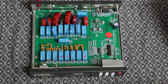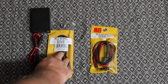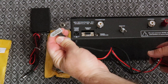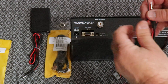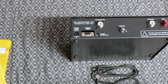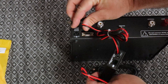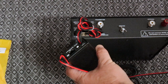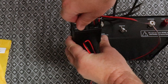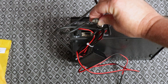These are the interface cables: the MFJ 5124 for ICOM radios and the 5124Y for Yaesu radios. For the ICOM IC-7300, plug this into the radio, connect the 12 volt power, and plug in the radio interface. For Yaesu, plug the stereo jack into the box, connect the red and black power cable, plug in the power cable that came with the tuner, and the 8-pin plug goes into the back of your Yaesu — in this case a 991 Alpha.